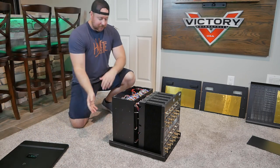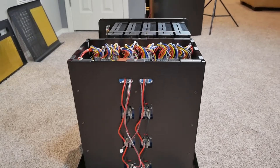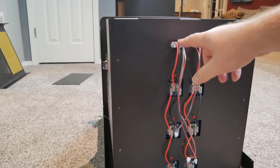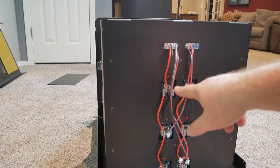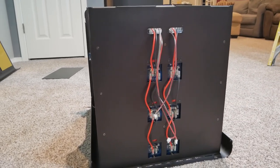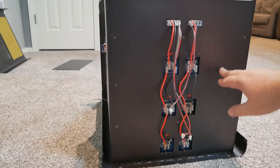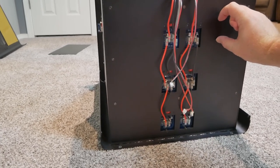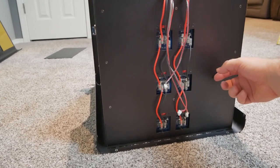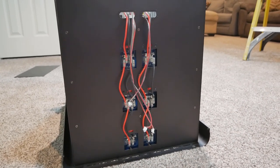The other little bit of bad news, I'm not going to take this front panel off. I'll show you why in just a moment. So here is the front panel here. Like I said, I'm not going to be taking this one apart. As you can see, the main power wires are coming in off the board and going down to each one of the levels where the toroidal transformers are. I could see just through the crack here on the side, there looked like two toroidal transformers up on this level. Those were maybe about 1.5 inches thick. These suckers on the main or the middle level, they were huge. They were probably about twice the size of the ones up top. I couldn't see on the bottom one. I wasn't gonna bend that back to find it.